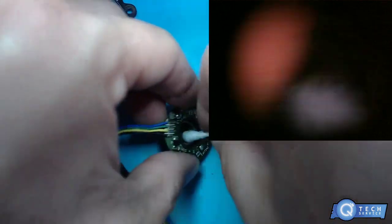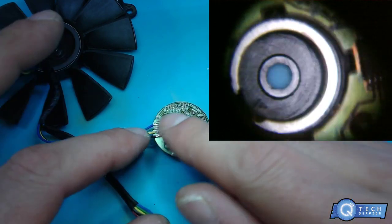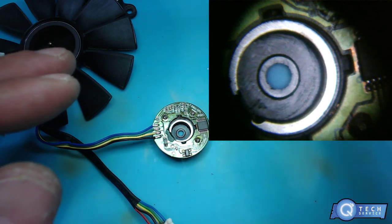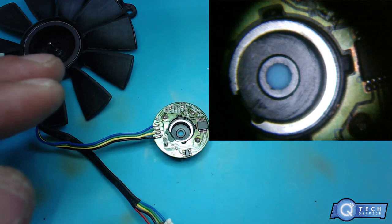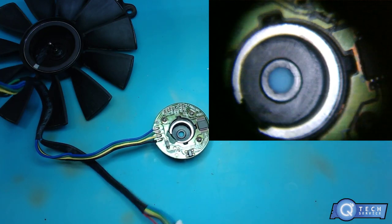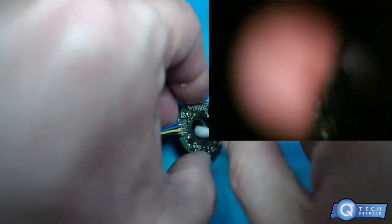So what I believe, to stop that from happening, they never had this little white ring super glued to this. It allowed it to just float around. So then it's uneven. The fan can go like this a little bit at the bottom part of it. It's sitting on the shaft and it's supposed to be free, but you had a lot of rubbing noise, right? Yeah, that's what I had. Every time it would want to start the fan, it'd make noise. I couldn't figure out what it is. So two of my fans were just sitting in the air like that.